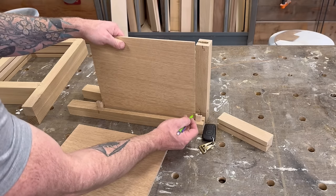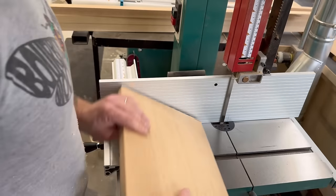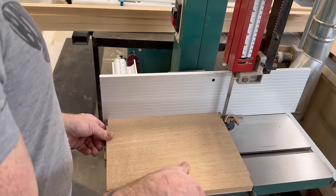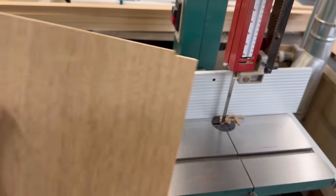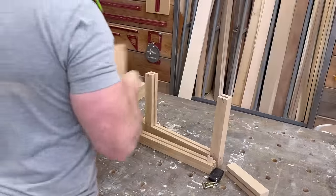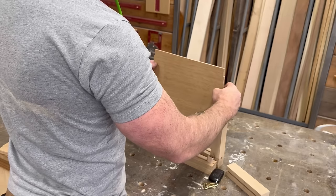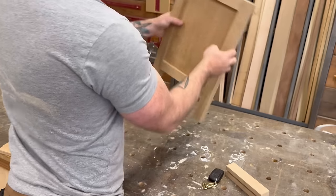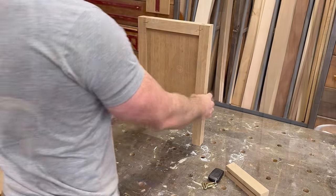The panels did run into the dominoes, so I had to mark out where the dominoes were and notch out the panel just a little bit to fit around them. If I'd done a true shaker-style mortise and tenon I could have avoided this, but a little notch here and there never hurt anybody. Now it should be able to slide right in next to those dominoes — look at that: a beautiful quarter sawn panel inside a quarter sawn frame.